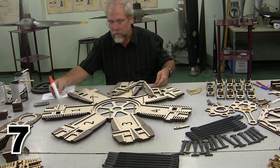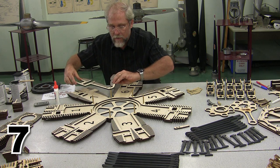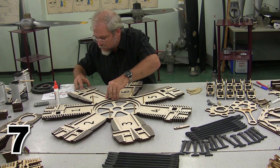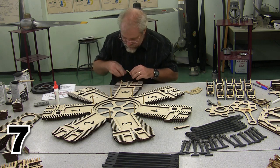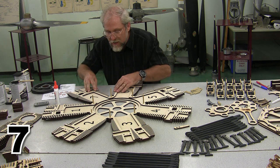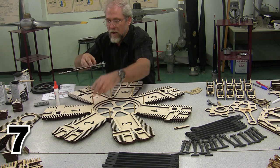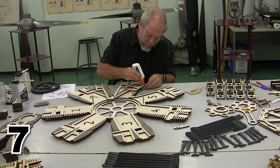And there we are with our first piece in position. I'm going to go ahead and bring this up, put it in place, lock it down, and I am going to get some more locator pins. And this is pretty important at this point. I want those locator pins up in the corners. And that helps to make sure that everything all the way around is locked into place. I'm going to keep going. While my glue is wet, I'm going to just keep on rolling.